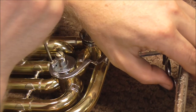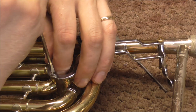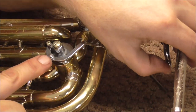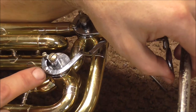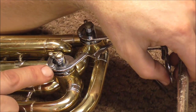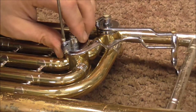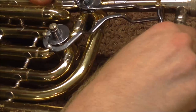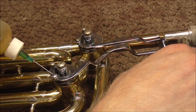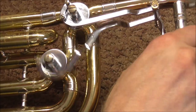It's a little tight. I am going to loosen this screw. That did not help, so that screw is probably not the problem. I am going to loosen this one — well, it works now. So the problem has something to do with that screw. I just replaced that screw because the other one was broken. I think what happened is this screw is clamping down on this, so I am going to file that down a little bit. I filed down the bottom of that little piece a little bit. Let's see if it works now. Okay, I think I got it — I think we are done. This is a little noisy because there is a lot of metal against metal moving, so I am going to put some oil on there and that should quiet it down. That is better.